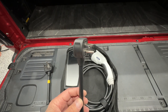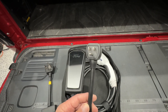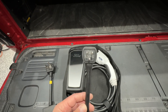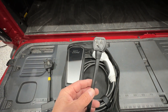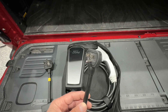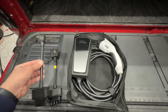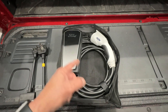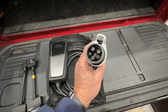This is a North American plug for a 15 amp or 20 amp circuit depending on what kind of circuit you plug it into — it fits both. This will plug into a 15 amp circuit; as we know, the mobile connector draws 11.2 amps. The mobile connector has a cord hooked up to a J1772 connector on the end — that's what this connector is called. It's on the better part of a 20 foot cable, allowing you to easily locate the connector at the truck.